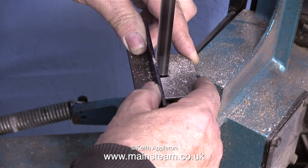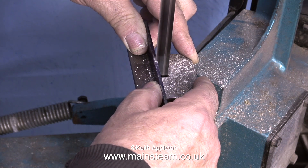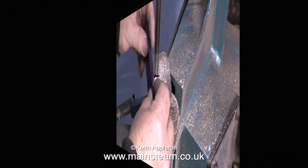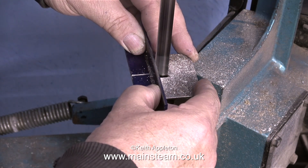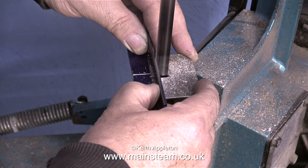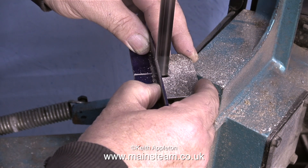I find that the bandsaw is the best way to cut small pieces of metal. If I clamp it in the vise and lower the blade in the normal way there's a good chance the blade will wander, but by controlling the piece of metal with my hand I cut the vertical part of one side and then turned the part over to cut the other side. By doing it this way everything remains nice and square, keeping my thumbs well clear of the blade, and in no time the piece of steel angle becomes two pieces.